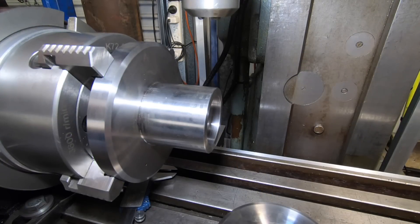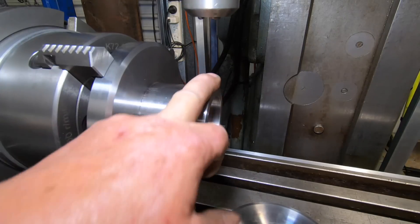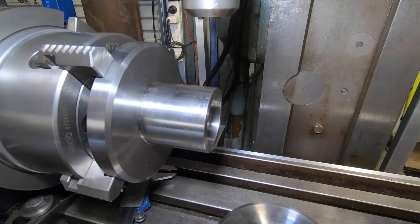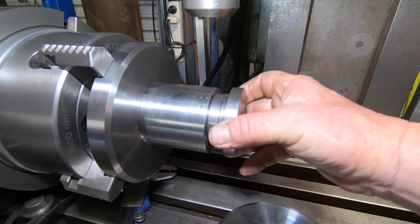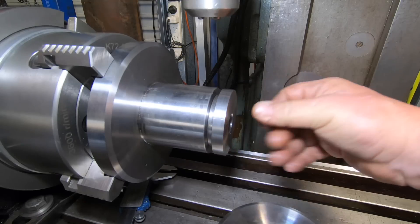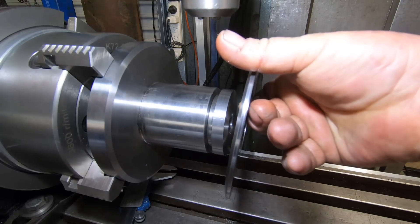What I've done here is set the rotary table up on the Cincinnati. I've got to put three holes in here, a hundred and twenty degrees apart — three threaded holes which lock this plate on. I'll lock the cap in, which in turn locks this in as well.